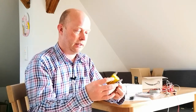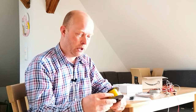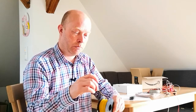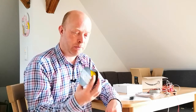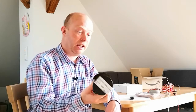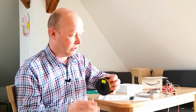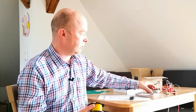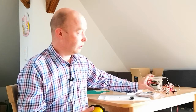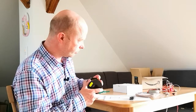So that's that. Then your clear heat shrink tubing, your ferrites, as I said, and then you're also going to need some wire for your antenna. I just use this basic switching wire. I think it's about 1.1 millimeters. Nothing special about it at all. I just picked it up, €7.80 for a 100-meter reel. And like I say, this antenna is still going strong. It needs to be quite thin, because of course you also want to get it on this reel. So as thin as it needs to be to get on one of these washing line reels.